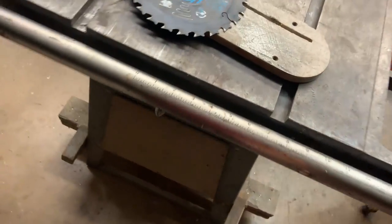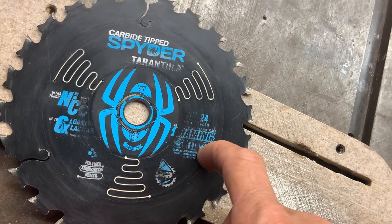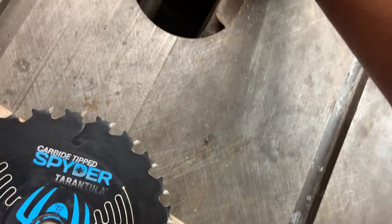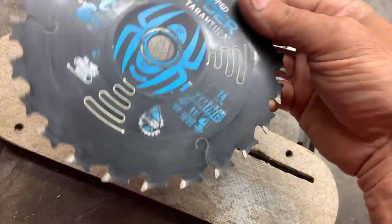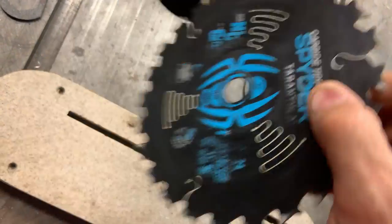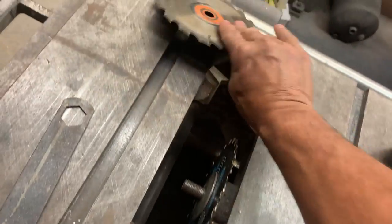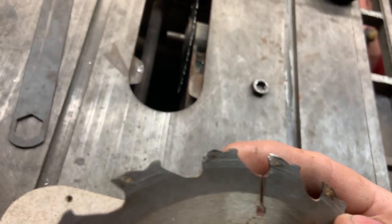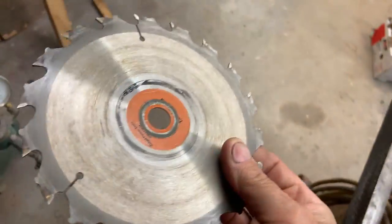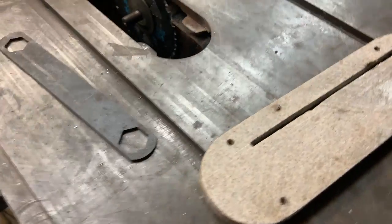This is a relatively new blade — carbide tip Spider Tarantula, I think I got it at Lowe's. I absolutely love this blade; it goes through wood so easily you can't even tell the blade is cutting. It's a sixteenth of an inch thick blade, so it doesn't have a big kerf — you're not removing a lot of wood per cut. This other blade is the one that came with the saw, which I've beat up badly with a couple of accidents — knocked the teeth off it. It's really a disposable blade now. I keep old blades like this that are no longer good for fine work.